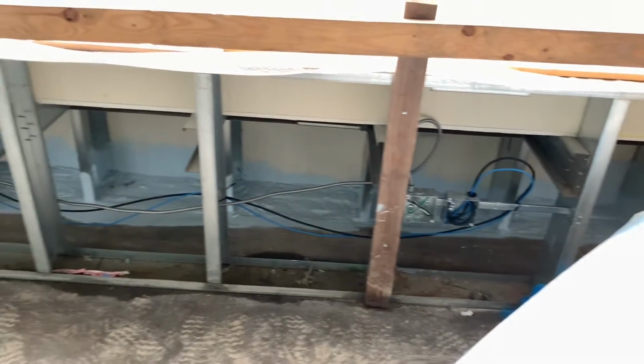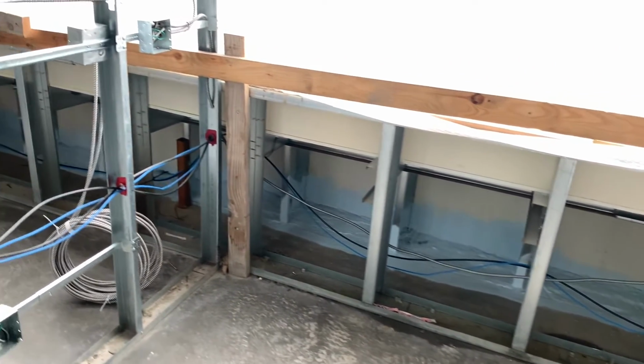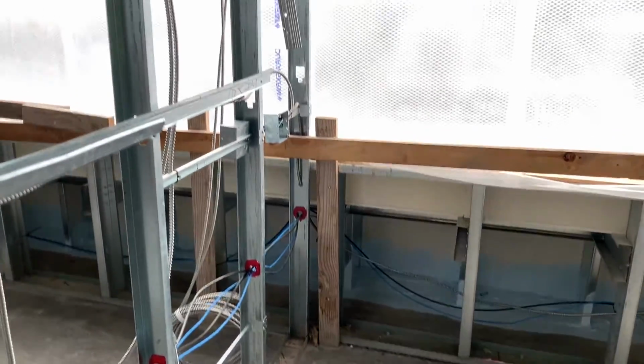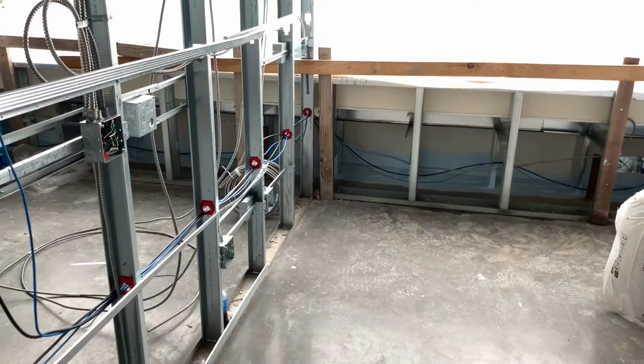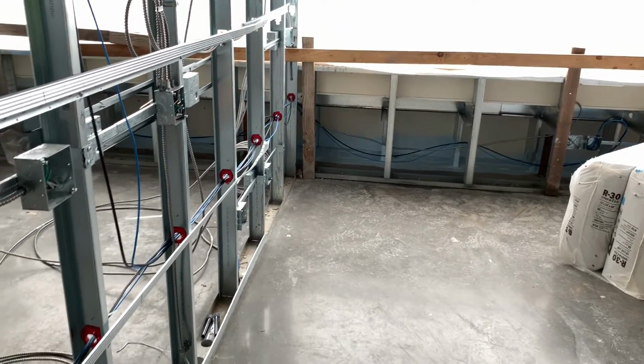And then this is another plug coming off the kitchen. It was supposed to be off the living room, but there's a column blocking it that's already sheetrock, so just hitting it off the kitchen. Microwave home run, dedicated. Range home run, dedicated. And then the kitchen, got all that completely done.